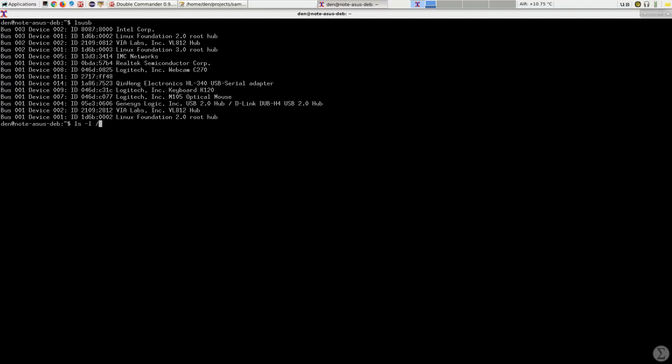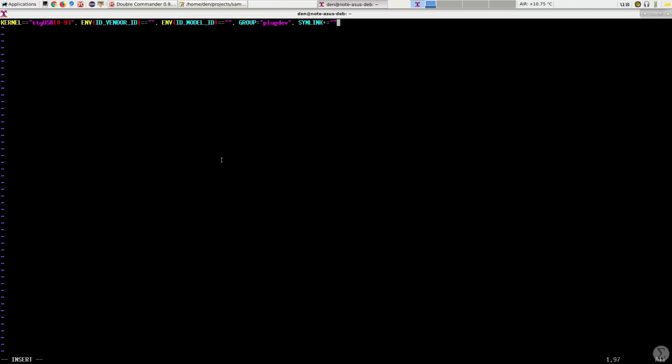The serial port access point we can find under /dev, and as you might notice, the name will be assigned dynamically using a numbered suffix. Also, the default group for this file will be dialout, which we are not a member of. So we would like to change it, and we would like to have a static name associated with the serial port. For this purpose, we can create a udev rules file. I will just use a pre-existing template here.